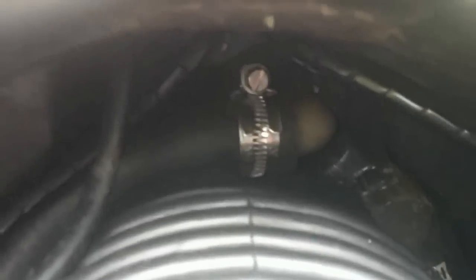Here we have the Alpha 1 Gen 2 bellows installed. This is the procedure: trim senders in first - easy access with everything out, that's if you put new ones in. Next is your oil line - that can be a real pain to get in. They used plastic clips which I couldn't get in behind the pipe, so I used a stainless jubilee clip and that worked well. Next is your 3 quarter inch water intake hose - warm it up in some water first. Jubilee clipped up, then tightened again later. UJ bellows on next with bellows adhesive and jubilee clip - quite straightforward. After that is the exhaust bellows, glued on with bellows adhesive on the transom and jubilee clip.